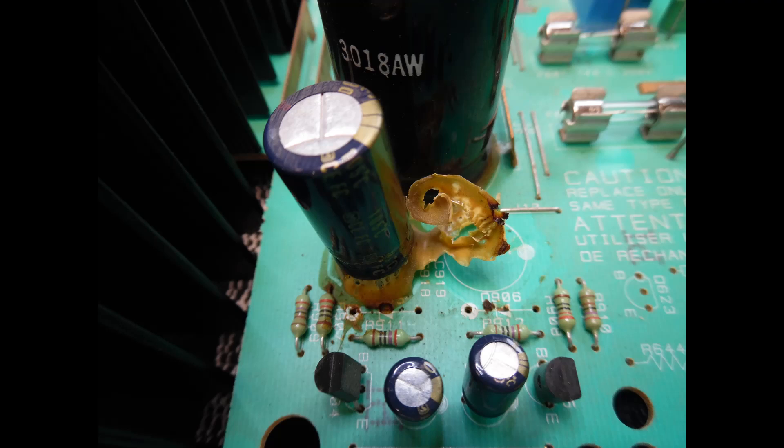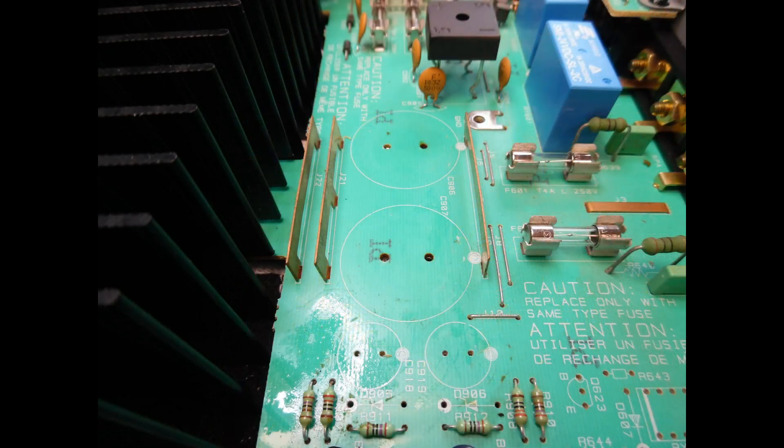As I've said on previous tutorials, you have to be very careful — what you don't want to do is go in there and start removing it with no eye protection. I really want to emphasize that because it will flick up and go into your eye and cause damage. What I've done is removed all the electrolytic capacitors in that area including the large power supply electrolytics, because you have links on the board and the last thing you want is this residual conductive glue coming across links, as it causes all sorts of problems and failure.